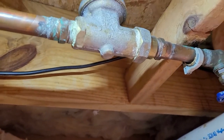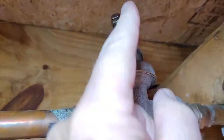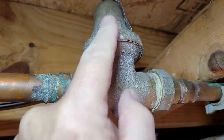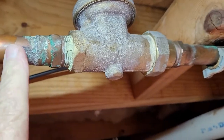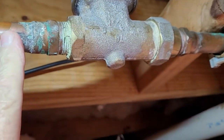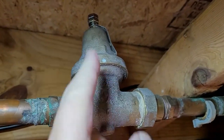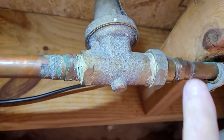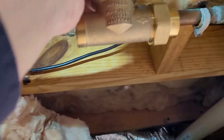Well, Nancy, it goes like this. The water comes in here, and this valve — you can see up at the top there's a bolt. It adjusts a mechanism in here that only allows a certain amount of pressure into the house. This is where the rest of the water for the house comes in. Normally we would just adjust that bolt and it would get the pressure right. But that's not working anymore, so we have to replace this with one of these. And you can see that's a pretty good match there.